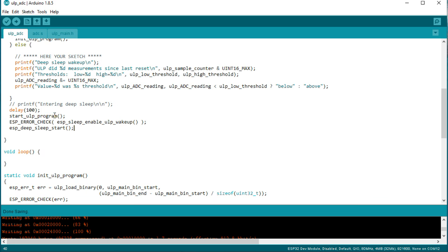This delay is only needed because the ESP32 needs some time to write the serial print message to the serial monitor. If it starts to sleep before the line is printed, you would not see it. In production, you can remove this delay to save energy. That's it — no rocket science, and this part can also be copied into other projects.